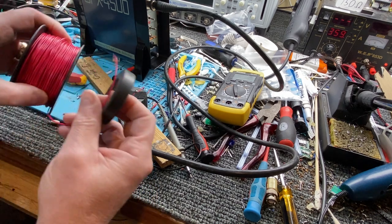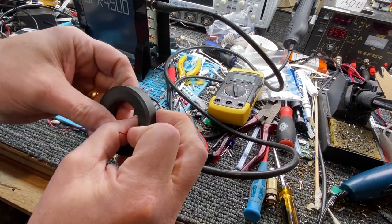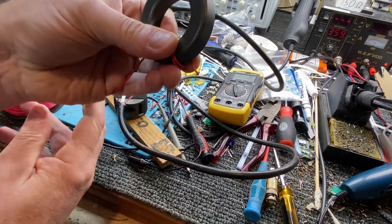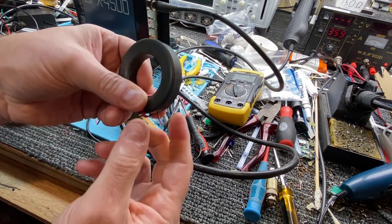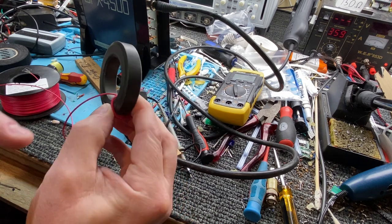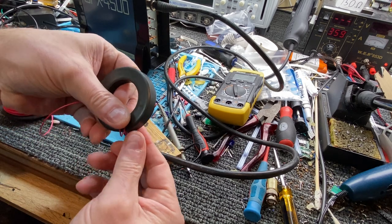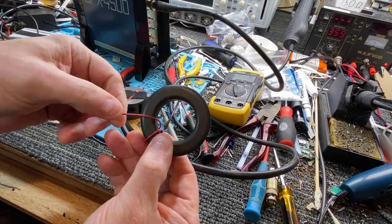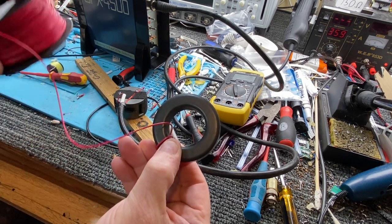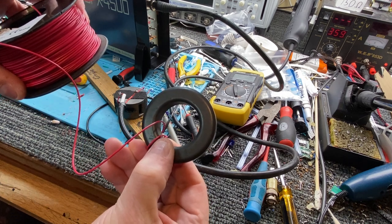Seeing is understanding in a lot of cases. Say I've wound on all these turns and I go, 'what's the inductance?' Well, I put one metre lead here and on the other lead, stick a pin in here. All this cable here — it will ignore it, it's not part of the circuit. So you don't have to cut your cable. And if you haven't put enough on, take your pin out and keep winding.